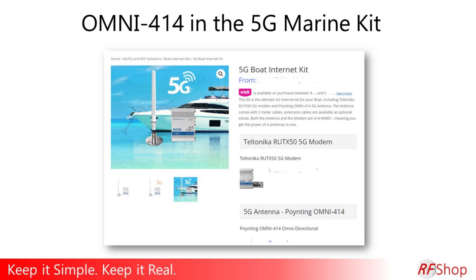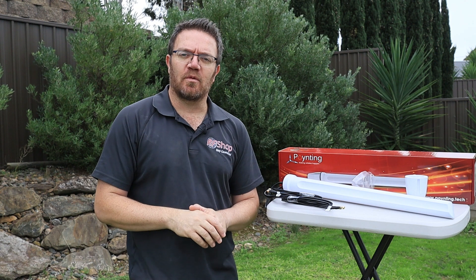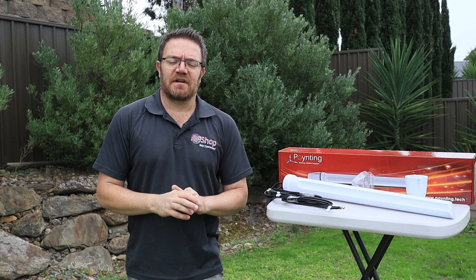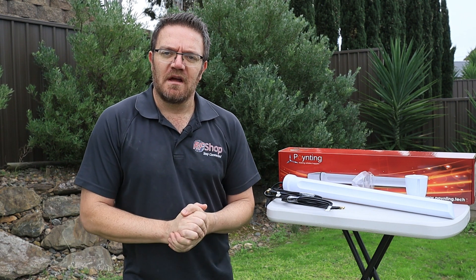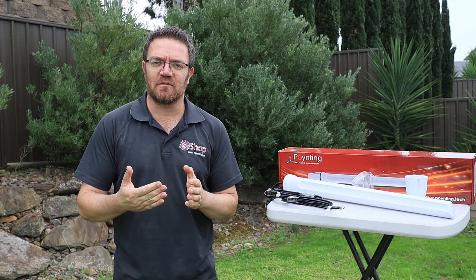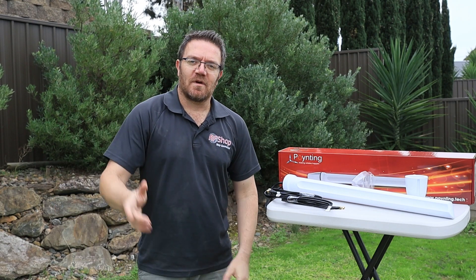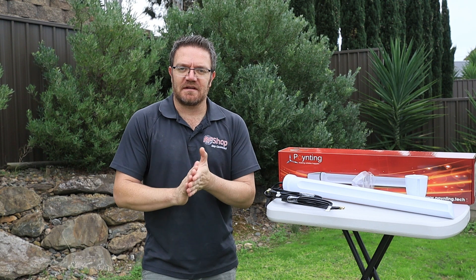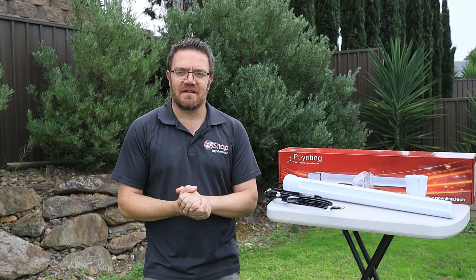The Omni 414 is what we're using now for 5G and it will get more and more relevant as you move into 5G. The one big thing to remember: you cannot use just one external antenna and rely on the internal ones for the rest — that's not going to work. You will see significant degradation of your 5G connectivity. That's about it for now — we'll spend more time on this as 4x4 takes more effort to set up. Thanks for watching, subscribe, check our website, and contact us with any questions.